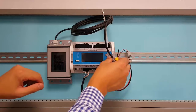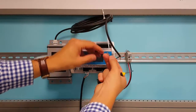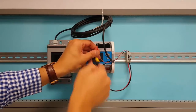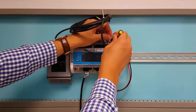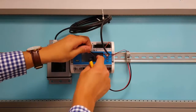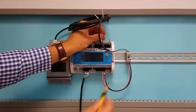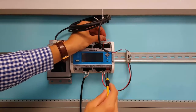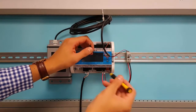Always start from input 1 for convention. Then connect the irradiation wire — that is the orange wire — into multi-input 1, denoted as MI1. And connect the temperature wire — that is the brown wire — into multi-input 2, denoted as MI2. Finally, connect the drain cable into ground.